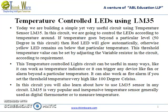Temperature controlled LEDs using LM35. In this circuit, we are going to control the LEDs according to the temperature around. If temperature goes beyond a particular level, for this circuit example 50 degrees, then red LED will glow automatically, otherwise the yellow LED remains on below that particular temperature.